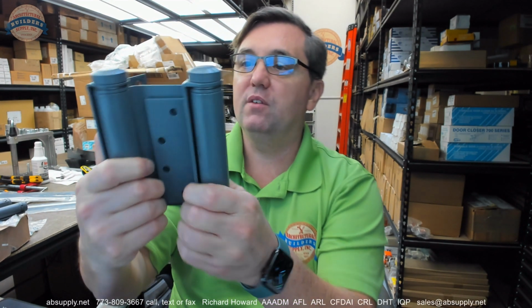If you've got a door that is, and we'll get to the weight when we get to the installation instructions, but you have to stay within the designed limits. This is designed for a 3-foot door that's 90 pounds. You would be able to open up that envelope a bit by adding an additional hinge, but the factory who makes this hinge, I've been to this factory. I've seen their testing room. Okay, they test their products very completely. So when they're saying that it's 90 pounds and up to 3 foot wide, that's what it is. It's not 130 pounds at 4 foot wide kind of stuff. And they're sold as each. When you buy one, we're going to ship you just one hinge. So be mindful of that.